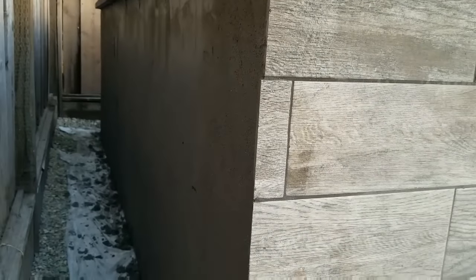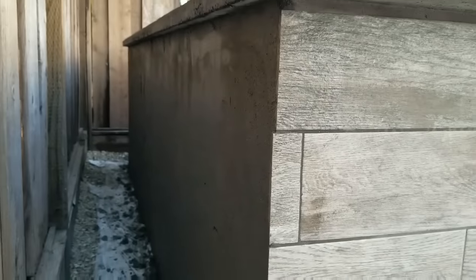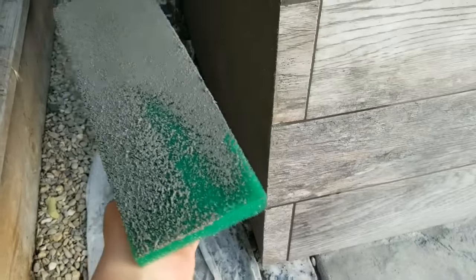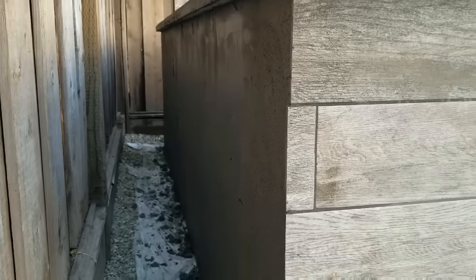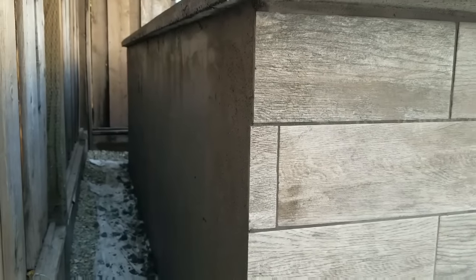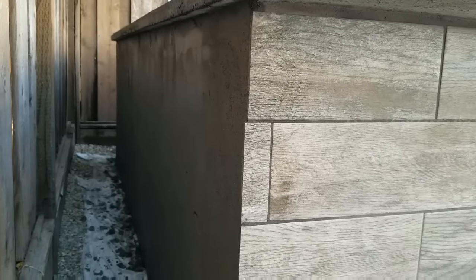This would be like a brown aggregate finish with all the aggregate showing instead of a smooth set, because this stucco is a fine stucco — it's supposed to be like a smooth set stucco. But I continuously washed all the aggregate off. It helps to have a bucket so you can dip the sponge and shake it off. I chose this gray color — they have white as well, and you could always dye or add different colors into the stucco using the little mixing bags. I want it gray so once it dries I don't have to do anything to it.